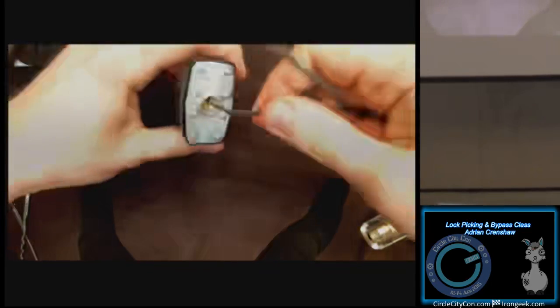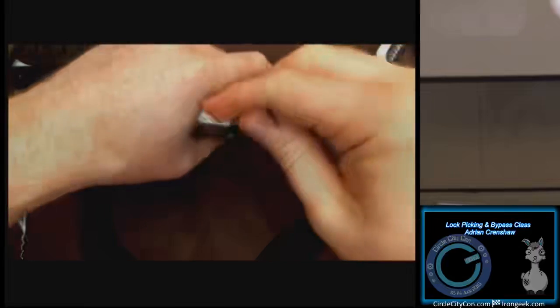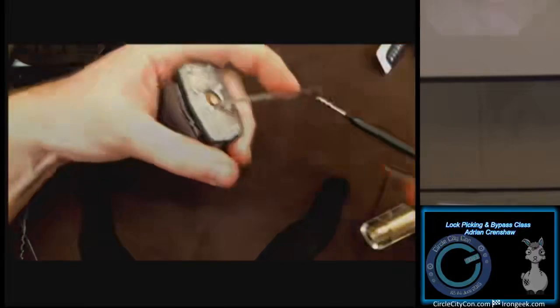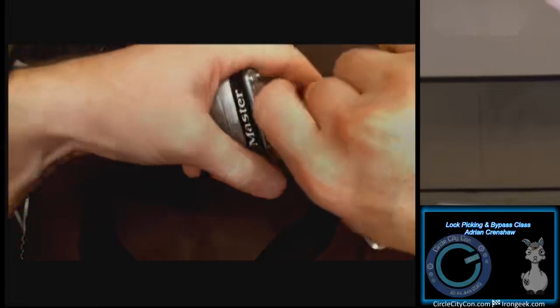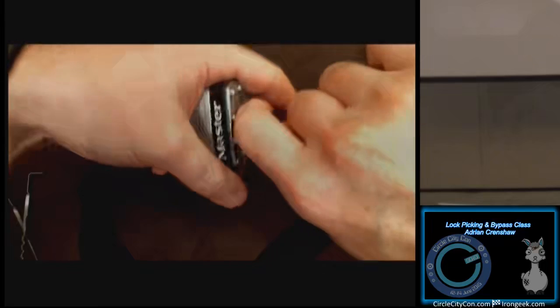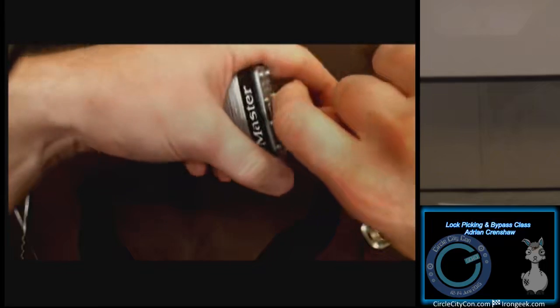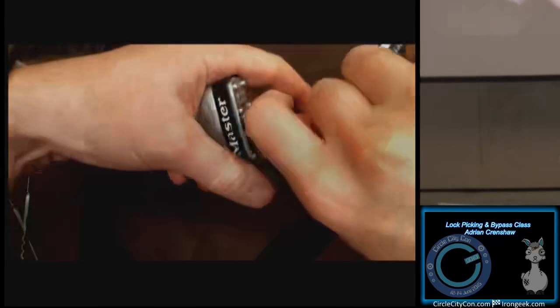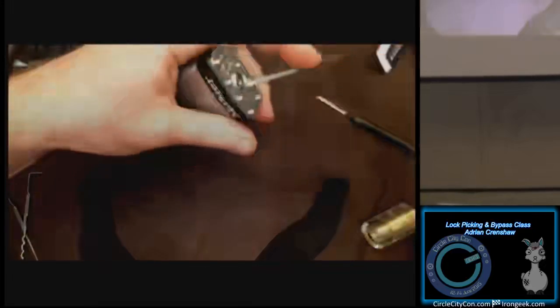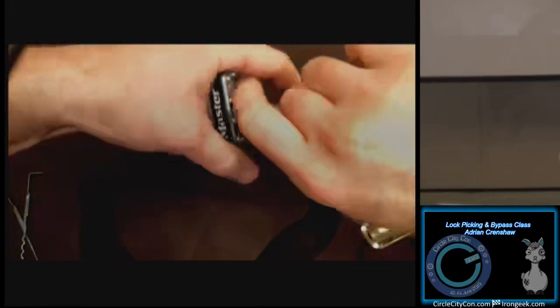Remember I mentioned imperfections in the lock? We'll cover a lot more of this in a second. Those pin stacks are not perfectly drilled. There's going to be imperfections where someone can hopefully get a tool in and open the lock by getting individual pin stacks to drive a pin and lock them above the shear line. And we're going to show a picture of that in a second. Let me try this a little differently. But this is the core idea of Bogotas, to have two tools and be able to open the lock.